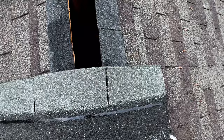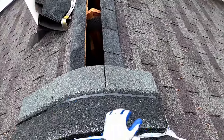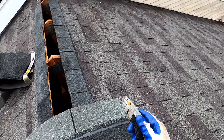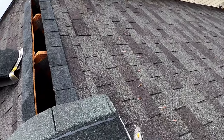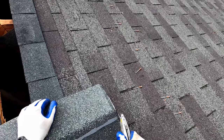And so, unless you're using a pre-made specialty ridge cap, this is the type of shingle that you'll make your ridge caps from. The way you do that, first you got your knife, has a hook blade on it. A straight blade's gonna do you no good with shingles. So you take your hook blade, and because I'm right-handed, I'll start on the right-hand side.